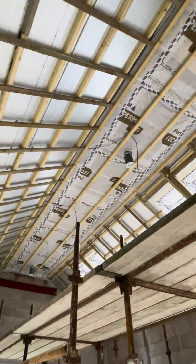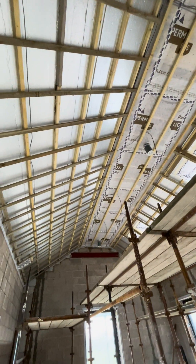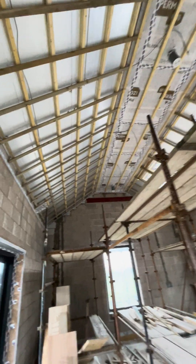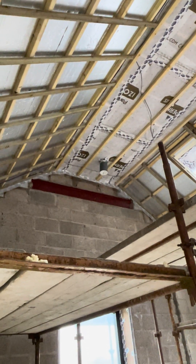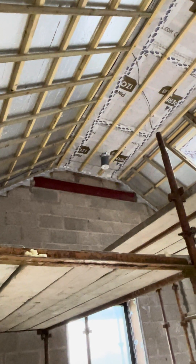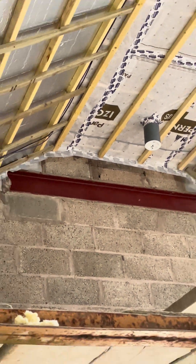It meets the wall where you tape with your plasterable tape and non-plasterable tape for doing all your joints. That's the MVHR duct sticking out — tape around that as well. Then we have the service batten, two-by-two and in this case another bit of two-by-one on top, for all your electrics. The steel up here is for structural reasons, but we would also paint around that with our Varifluid product, because you'll get a lot of leaks where the steel meets the mortar when it dries out.